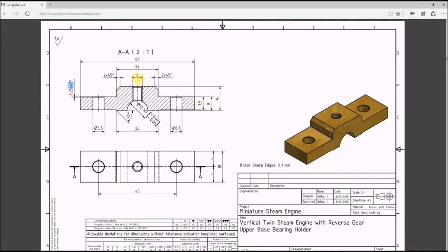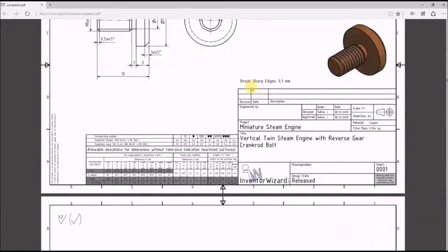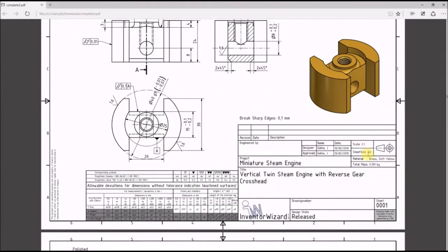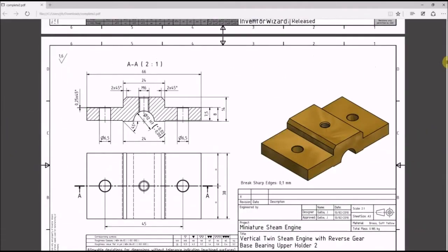and the way that you will know the difference between whether it's a chamfer or a fillet is that with fillets, they will actually give you radius measures. Let me see if I can find a part real quick with a fillet instead of a chamfer, and I will show you. If not, then oh well. I'll just have to show you later whenever we come upon a part that has it. But for now, most of what we do will be chamfers, and that's signified by the depth and the angle at which that chamfer sits.